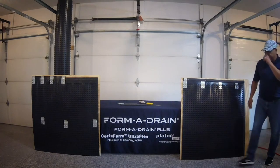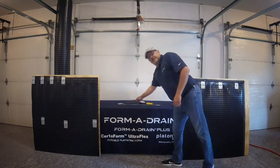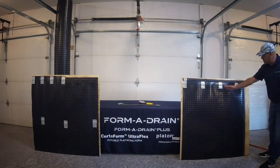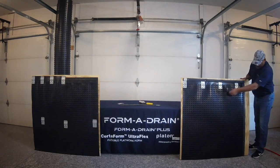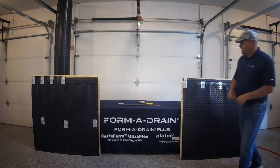The other thing about molding is that when you use one of the other systems, you still have to have molding on site for use along termination edges. Or if you have a walkout or a change in grade, you have to cut the termination strip off and then use the molding strip to seal that edge as well. So I showed you an example here of an end termination and the top installation.